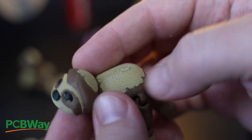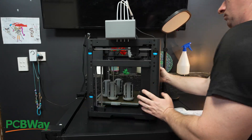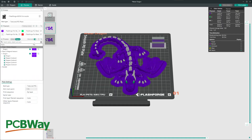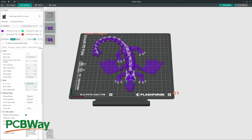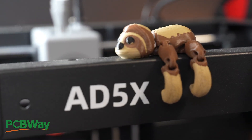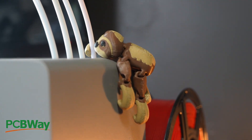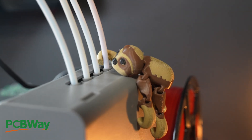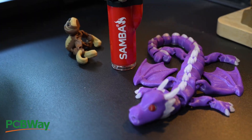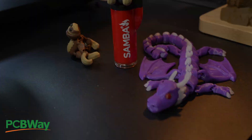So where do I actually stand on this machine? The screen is frustrating, the build quality feels a bit cheap, and the slicer is a bare-bones copy of Orca that's missing critical features like purge waste calculations. But the print results are good — I didn't get a single print failure, it printed fast, and the quality is completely usable. Is it worth it? That's the question with any budget gear: you pay less, deal with the annoyances, but still get results you're happy with. That trade-off makes sense if the price justifies it.